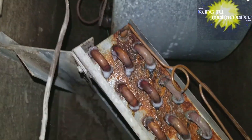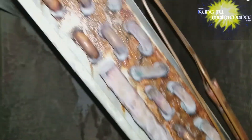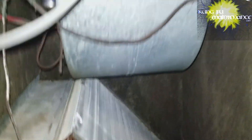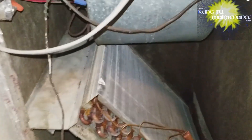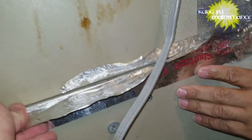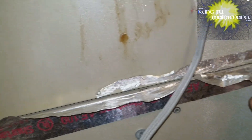This one's going to start frosting up real fast. But anyway, that's the slant coil — the difference between the slant coil and the A coil. I actually like these a lot better. It's time for a coil cleaning. Originally the filter would sit right here, right up against the coil. We've converted ours to be in the hallway just to make it faster and easier to change filters, but it's actually a little bit better for the filter to be right here — there's less dust being sucked in. The more convenient something is, the more likely it's going to get done.